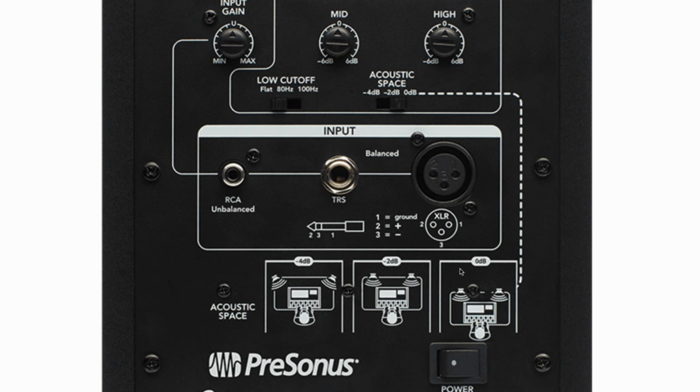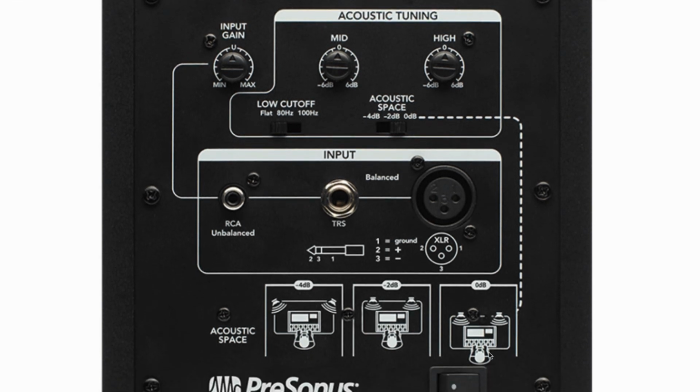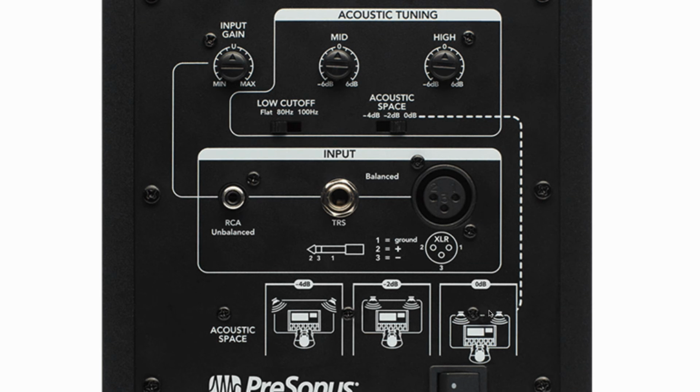And then in the final picture, the speakers are freestanding. They're not near to the rear wall or the side walls. In this kind of scenario, you do not get any bass boost, so you have the option there to leave the switch off, so there is no bass reduction. And I think it's a very, very clever idea that you've got the ability to just use this switch to balance the bass according to where your speakers are located in a typical room.